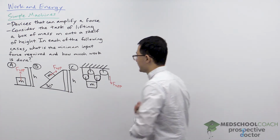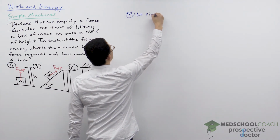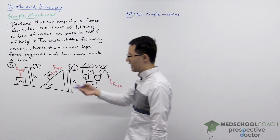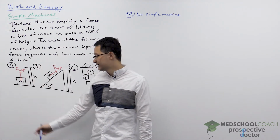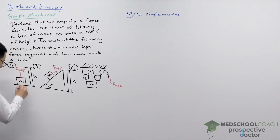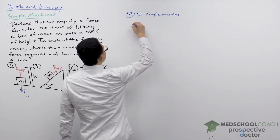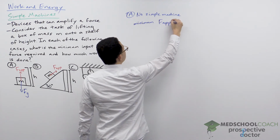All right, so let's go ahead and start off with the first case, A. So in A, there is no simple machine. So we're just going to use our brute force and just lift this box straight up. Now, the force that we have to apply to lift this box essentially has to balance out gravity, right? The reason why this box doesn't just float up in the air is because gravity is present. So we need to exert a force that can balance out gravity. So that would be the minimum input force that we need. So the minimum force that we need is simply gravity,